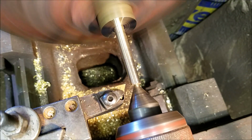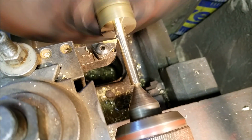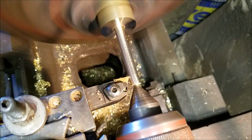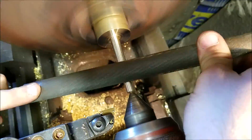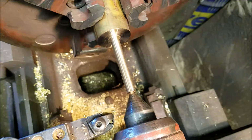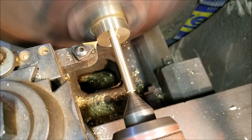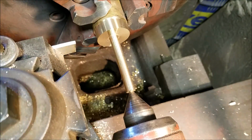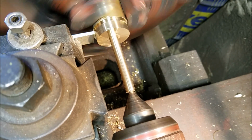Obviously, actually vaping at 7,000 watts is insane, but as I've covered in my PWM videos, you may not need 7,000 watts, but what you might need is the ability to put a lower coil in it without worry of overloading your battery and your components. If I'm going to be putting a 0.05 ohm build in it, then I want to know that the lipo that I'm driving that with is going to be capable of handling it.